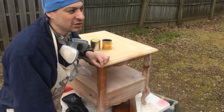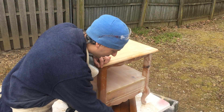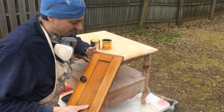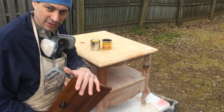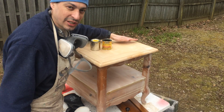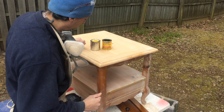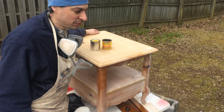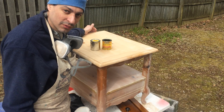For most applications, you're probably going to want a container of some sort for mixing. Depending on what you're doing, you may need a color sample. This is a door off the customer's bar — we're looking to match these as close to this as possible. What you want to do, which I already did ahead of time, is dust off as much of that sawdust as possible, get it out of the grooves. You can use a brush, your hand, a rag, or if you have a compressor, blow it out.